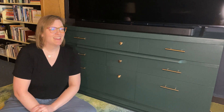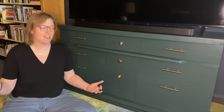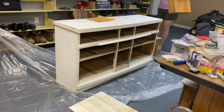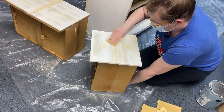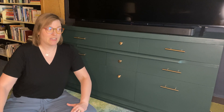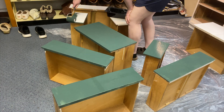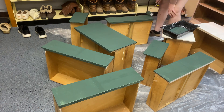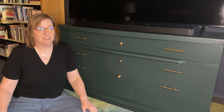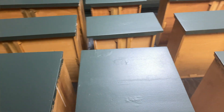Here's where I started to make some mistakes. Because I had overfilled all the gouges and grooves, I needed to sand them down. I didn't want to take all the pieces outside, so I hand sanded inside the house with a tarp laid out, using a couple different grits of sandpaper. I thought it was fine, so I primed and painted — but it wasn't until after I finished painting that I realized it just did not look good. The faces of the drawers were really bumpy. They had felt smooth before painting, but once paint was on it, it was very obvious I hadn't sanded enough and that there were grooves still filled with putty.